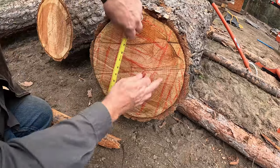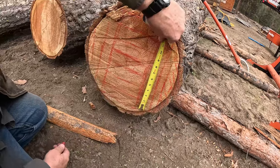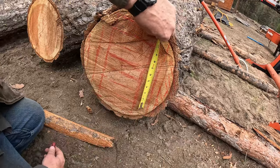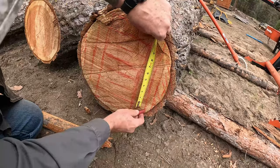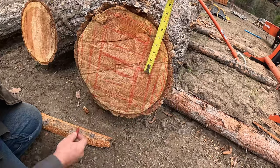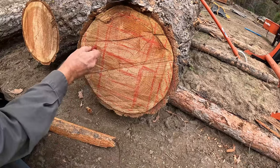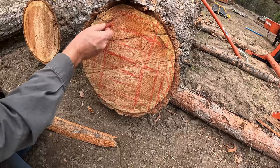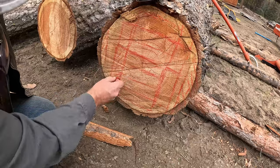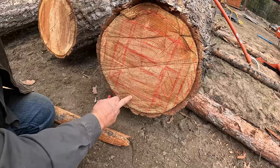And then what we'll do with these slabs, these flitch cuts is what these are really called, is we'll look at those and see, we can't get 2 out of that, but what I could possibly do is get 1 from here to here, and then I get a 4-inch out there. And I should be able to do the same thing right here, get my 4-inch, which would be there, and then my 6-inch would be here. So this one will come out of here. This one will come out of here. These will be 2x4s. Those will be 2x6s.